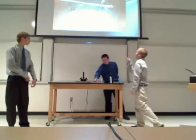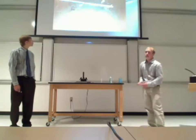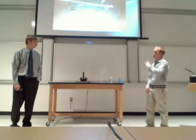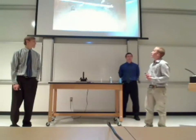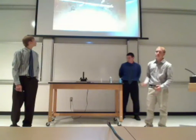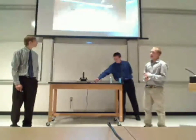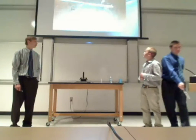And here's the second model of our coil gun. We started out with this 1-inch single stage down here. It's the same gauge of wire, but it's wrapped in 2 layers. And that works well enough to project the BB out the other end of the barrel. So then we moved on. We added 4 more single stages with space in between. The timing was off on those, so they didn't propel the BB out the end of the barrel.